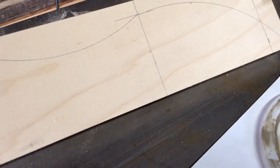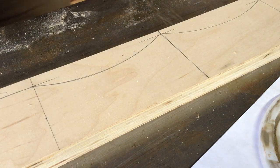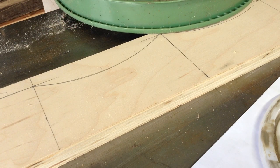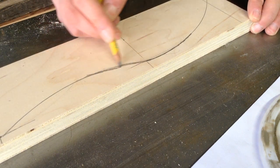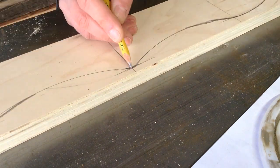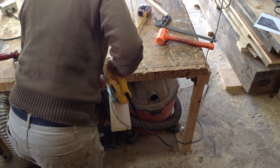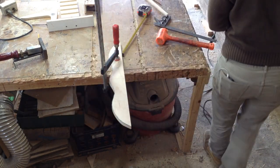For the bottom, the original drawing had a decorative arc with a flower carved on it. To start, I'm using a scrap piece of plywood because this isn't structural — it doesn't have to be fancy. I was just using a five-gallon bucket to create some arcs, and then with those arcs I smoothed over the curves with a pencil to remove the sharp points. By eye and with that bucket is how I'm creating these curves. Once I had that, I cut it out with my jigsaw, then I'll edge-band the bottom edge so you don't see the plywood edges.